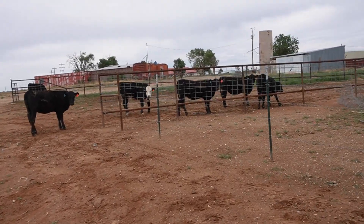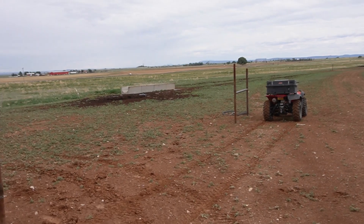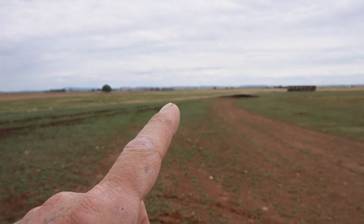I've been having a problem with my GoPro, so what you didn't see me do is put in these T-posts here and this five-wire section. You can start to see the entrance or the gate — this would be the entrance to the alfalfa field right here. The next chunk we got to build is from here over to those braces over there. The way we're going to do that is I'm going to take the barbed wire, run it down there and unroll it. I think I have enough of a continuous strand to do two wires, but we just need one wire to get the T-posts lined out. I use the bottom wire as a guide so I can get all the T-posts in line — that's what I use as my string line. So I'm going to go ahead and get this wire rolled out and we'll see if I got enough.